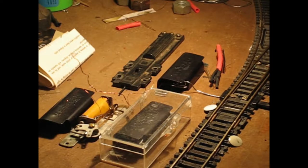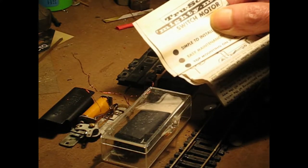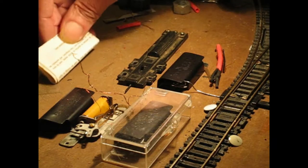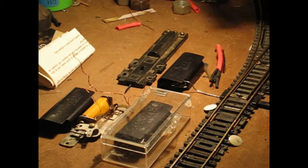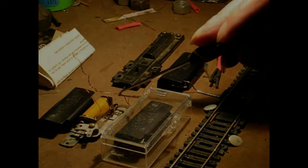I don't have the funds to go crazy with switches, so I wanted to at least get this reliable so I could do testing. There were switch machines made by a company called TruScale — Mighty Might switch motors — simple to install, top mounting. And they had a relay in them to either run auxiliary lights or electrofrog or whatever you wanted to do with it. So that was an option to try and correct this problem with these stupid little Atlas solenoids.